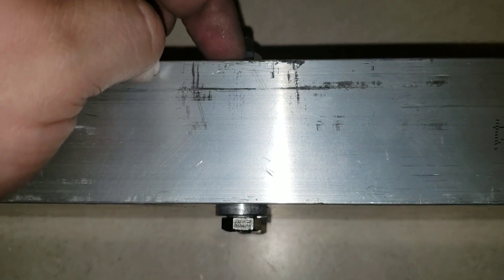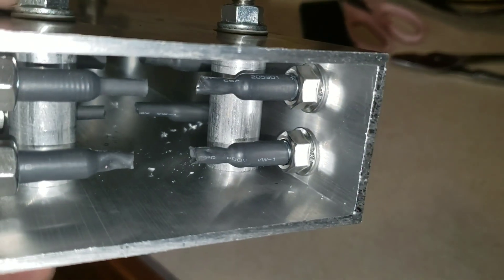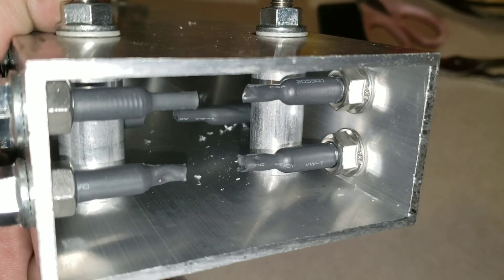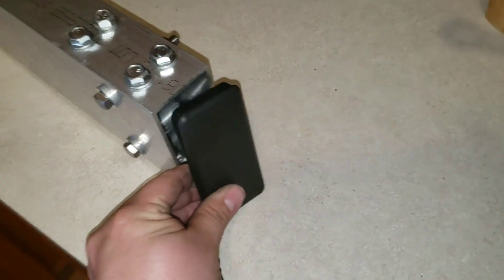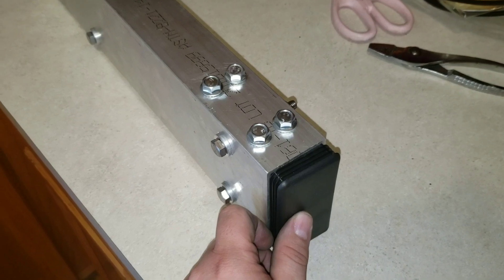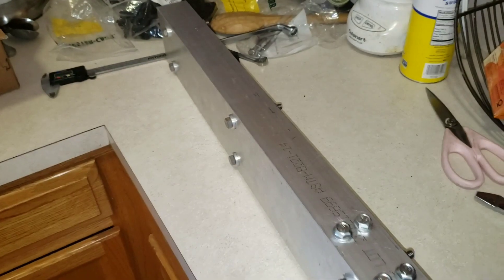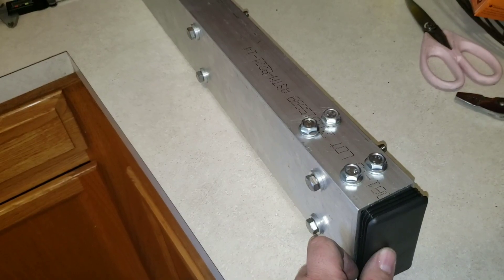I have the two-inch long, three-quarter-inch aluminum spacers going through. They butt up against the inside of the column, and I have a bolt with a washer and a nut to hold the spacers firmly in place. For the four side supports, I have nuts on the inside and the threads are covered in heat shrink tubing to protect them from when we cast the epoxy granite mixture. I'm going to pop on one end plug, then mix up the 80% sand and 20% resin mixture, fill the column, and try to shake as much of the air out. Then this column brace should be ready to get drilled, tapped, and installed. We'll do a next video on filling this with the epoxy granite, and then the final video will be the installation and demonstration.